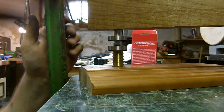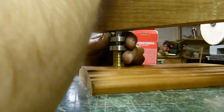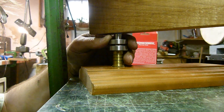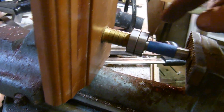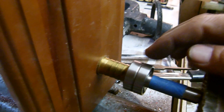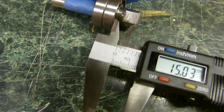Now we're going to press the second bearing in. We'll see if this will go down — it moved, we've got to move it over a little bit. There it goes, get it lined up. Right down in. Now we've got to line up a little bit more, and we're going to run out of clamp again. So the last little bit, we just moved it over to the vise. I've got my spacer down inside this tube and there's the two bearings — they're pressed almost to the end where they need to be. There's a little bit more to go, so I'm going to do this in a few steps, measuring each time to make sure we don't have any issues. I want to get this within a half a millimeter. So there we have it — we're at 15.03 millimeters, and we need it to be within a half. So I guess we're done pressing the bearings. Our little bearing press worked pretty good.